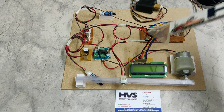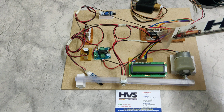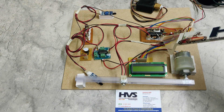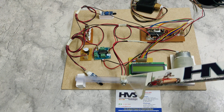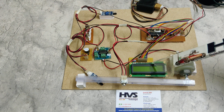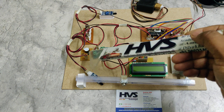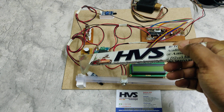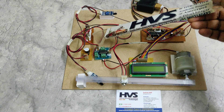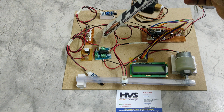The IR-in and IR-out sensors are interfaced at the A0 and A1 pins of the ATmega328P microcontroller using Arduino pin notation. A4 and A5 — the SDA and SCL pins — are connected to the MLX90614. Pins 2 through 7 are connected to the LCD module, pins 9 and 10 to the L293D motor driver, and pin 12 is for the buzzer. A breadboard is used to distribute the 5-volt power supply to the IR sensors, buzzer, and L293D motor driver.